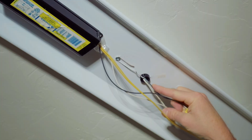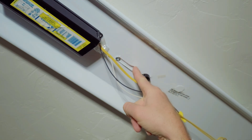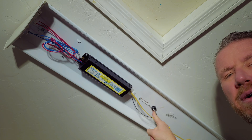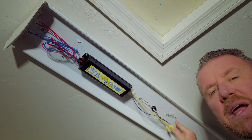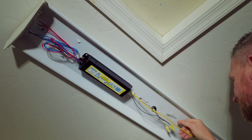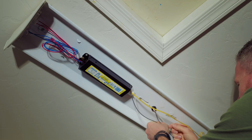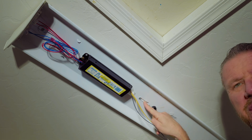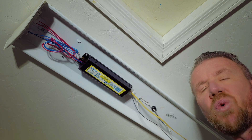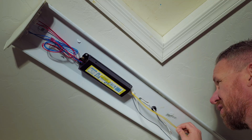We've got a few things going on here. You have your black hot wire, as well as your neutral, as well as your ground that should be coming from the ceiling through your access hole. This is the main power into your ballast. So we'll go ahead and just unscrew our caps here. Now we've got our black, our white, and our ground is mounted to the housing. We'll set those wire nuts aside and reuse those in a later step.